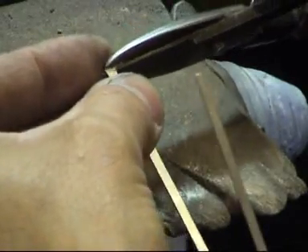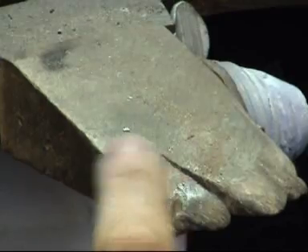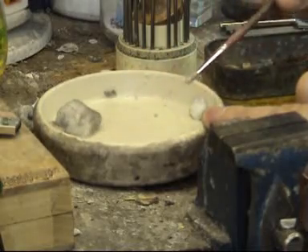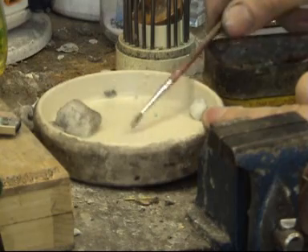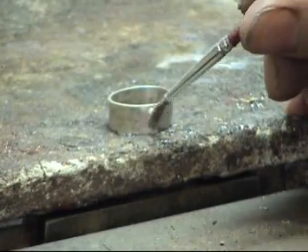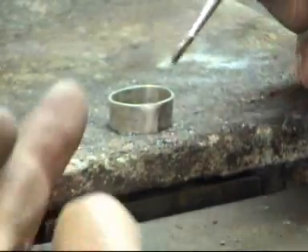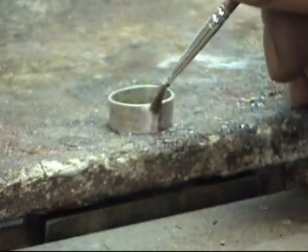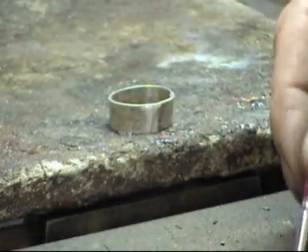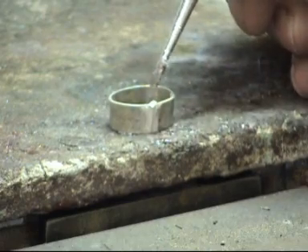I'll do a little bit more as we have a bigger joint to use. So we have the solder ready. We'll mix up our borax and use our paint brush — as you can see it's just like a cream consistency. We'll paint that onto the job, on the outside and on the underneath as well. Due to capillary action, the flux will be taken into the joint. Then using the paint brush, put the solder up on the top of the joint, like that.